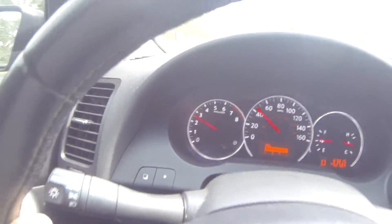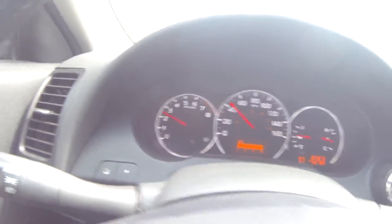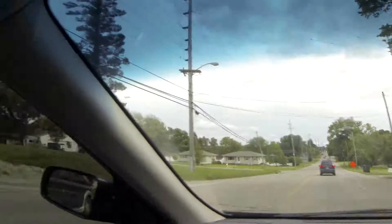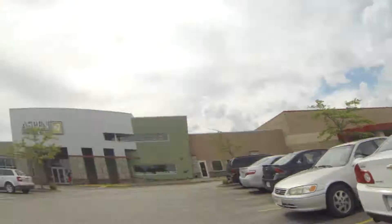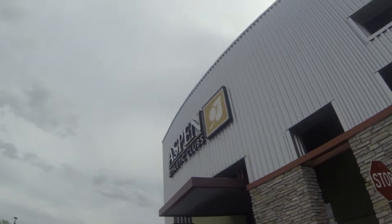It's a bit of an unorthodox deck because it doesn't have like normal railings like most decks do — it just has like a fence really that's on it. I'll probably have to use brushes for all that; I won't get to use my usual pad. A good thing though is it's not super high up so I can use the scaffolding that I've taken a liking to recently. We're also going to use a solid stain because on the floor up there it was red and he wasn't really a fan of it — he just wants to go back to brown. So to make it look uniform, we're going to use a solid stain.